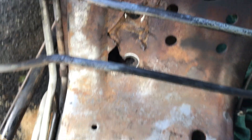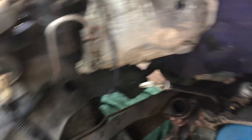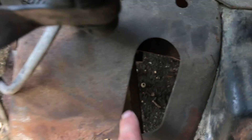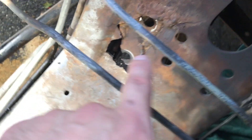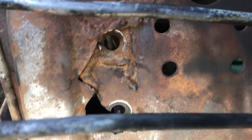For those unfamiliar with this location — normally there's an engine sitting in this area — here's the engine bay. Front of the truck, back, and what belongs here is the bracket, the axle pivot bracket. There's your beam that goes to your passenger side, and there's your beam that goes to your driver's side, bolting right here. What was happening was it was giving me just enough play to get death wobble. And I mean, look at it — it's just bad all the way around.